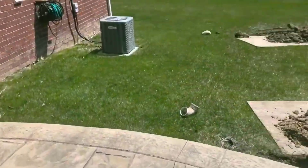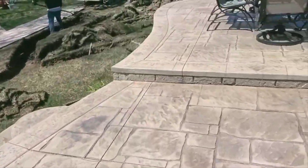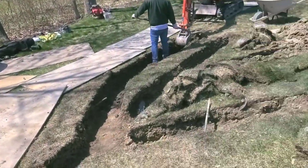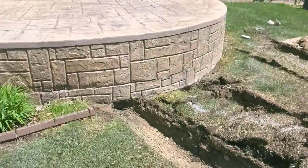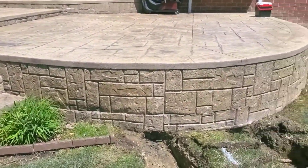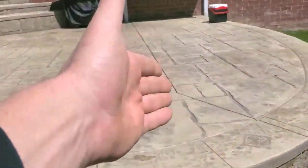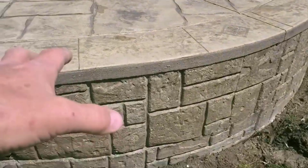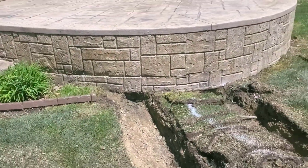What do they lift these patios with? Some sort of base material. In my world, you always lift it with one-to-three-inch clean aggregate — I don't care what it is, just one-to-three-inch — because water can't sponge up with that. But no, they use fill sand in a lot of cases. They just pile up the fill sand, so when it does rain and there are saw cuts everywhere, the water finds its way in during rainstorms.